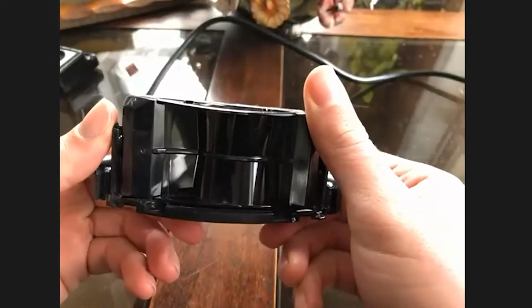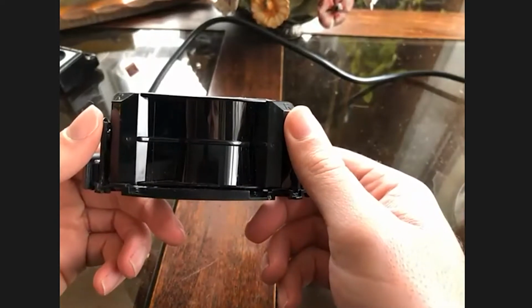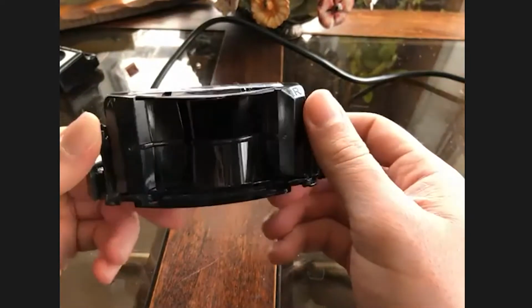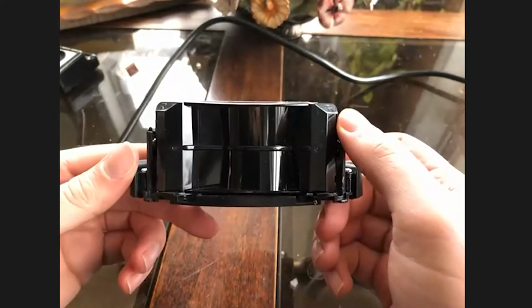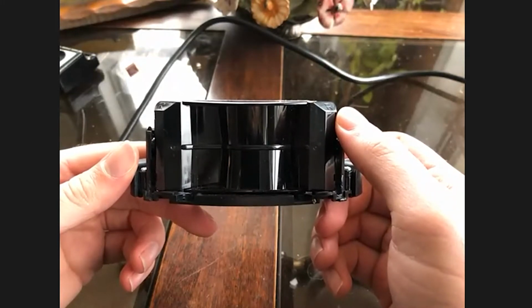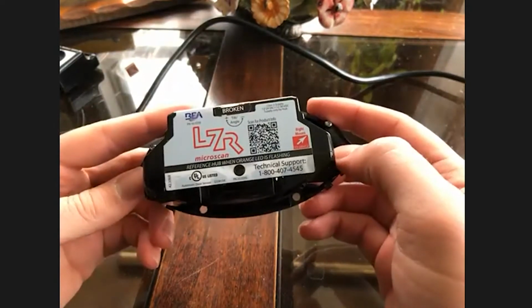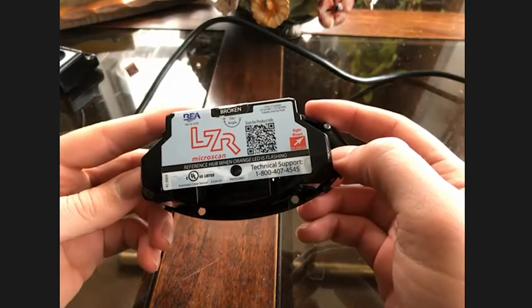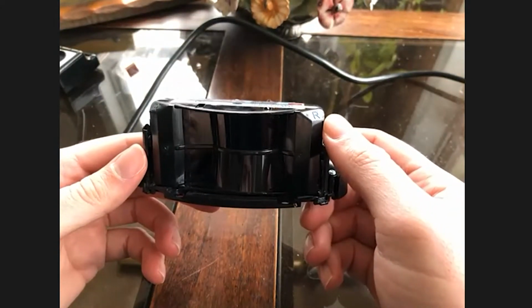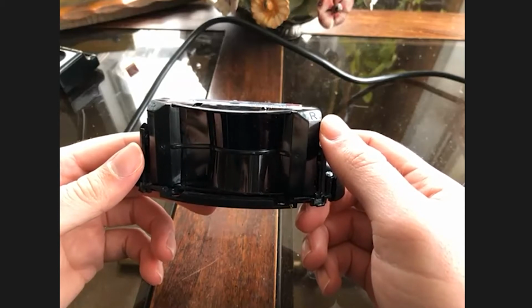So now you could simply remove the sensor heads from the door that is good and just really quickly swap them out to the other door just one at a time. And you know that they're handed, so you can properly put them in, and you can troubleshoot and say, okay, this one sensor causes me the problem. Or if the problem stays there, even though you put in a sensor head that has been fully tested and is working, you go, okay, that's my harness, because I have a good sensor that I verified. So this is a really easy way to troubleshoot a system, and knowing how to remove these sensor heads makes it really easy for you.